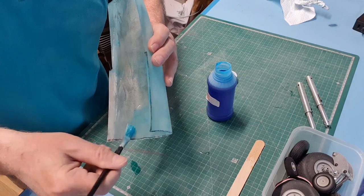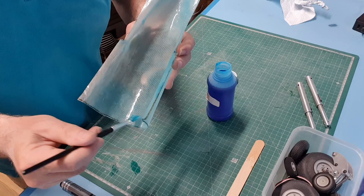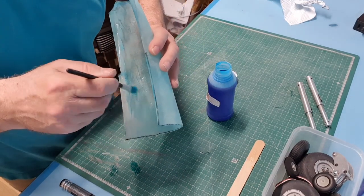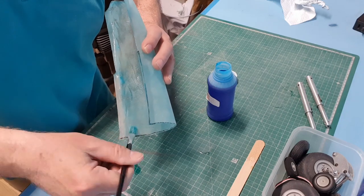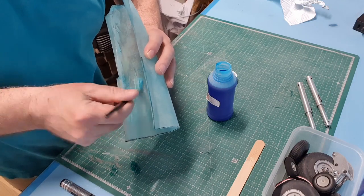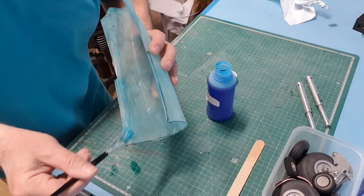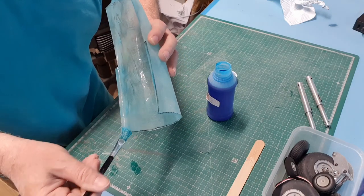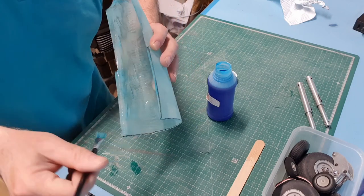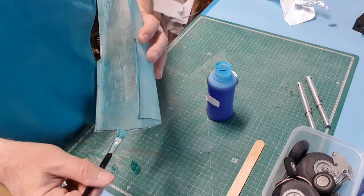Usually the mold is polished really, really highly, and then waxed and waxed and waxed and polished some more. So the fact that this mold is not polished, it's not really rough, but as it was cast, the PVA has probably got a lot of work to do to try and release the part, but we'll give it a go. Now I could let that dry and then give it another coat, but I think because it's a nice thick coat, we might be right. But I'm going to let it dry anyway.